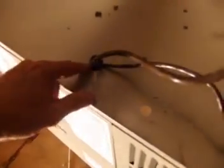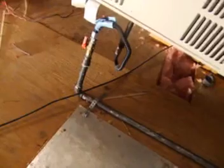AC unit. Cold pipes coming through here. Insulation in place. We have a couple of control cables going through the metal cabinetry. Metal cabinets can cut those when they don't have a bush, and it hasn't got a bush. Gas supply is fine. Got flexible pipe and steel pipe going into the cabinet.